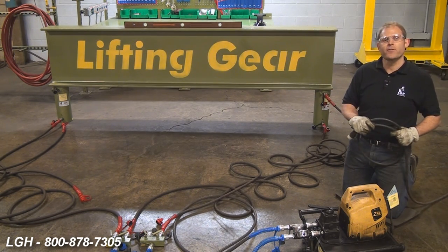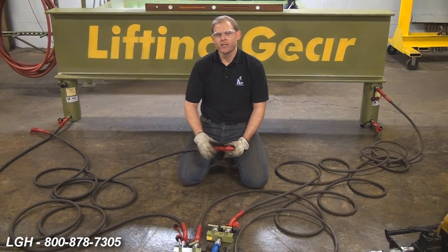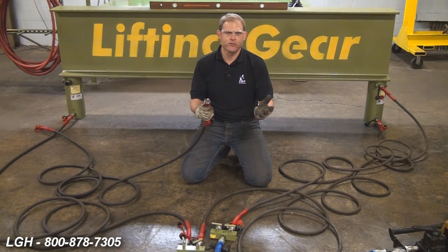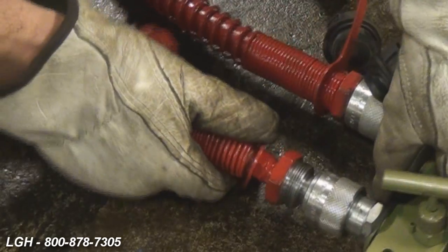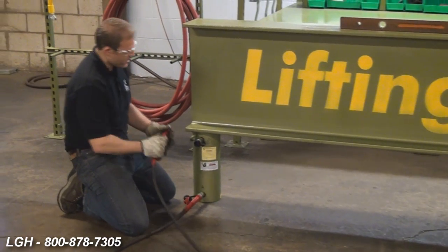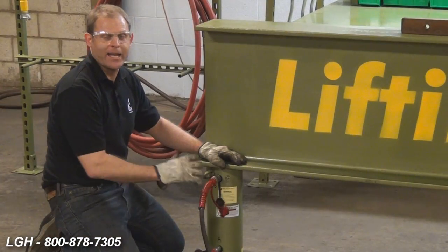Ensure that you have the proper electrical requirements. Even though they're very similar to single acting, be sure to check the electrical tag that's permanently affixed to the pump. There's an advance manifold and a retract manifold. I've already hooked up the hoses on the advance side; now I'll demonstrate hooking up the hoses on the retract side. Grab the hose, remove the dust cap, and make sure it's free of any dirt or debris — if not, wipe it down with a clean towel. Take the male end of the hose and insert it into the female end of the coupling. Engage it and hand tighten only; this is an area where you do not want to use channel locks. Repeat the process with the hose and the retract port on the cylinder itself. After it's secured properly, begin to test the system before any operations start.